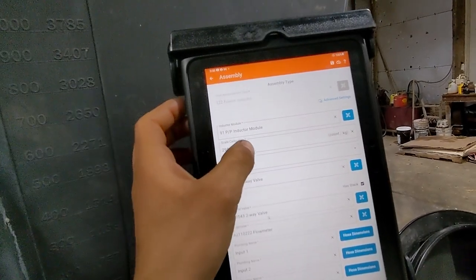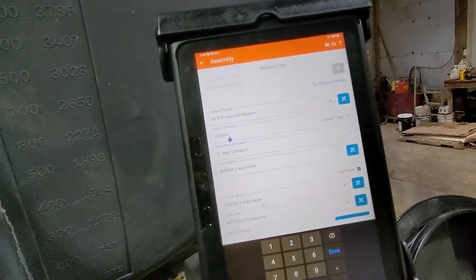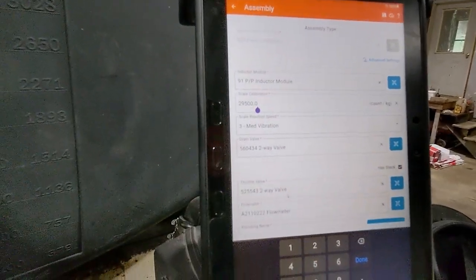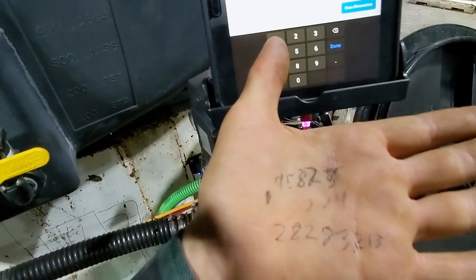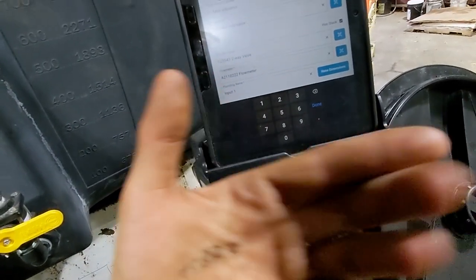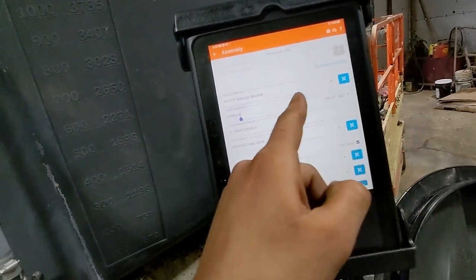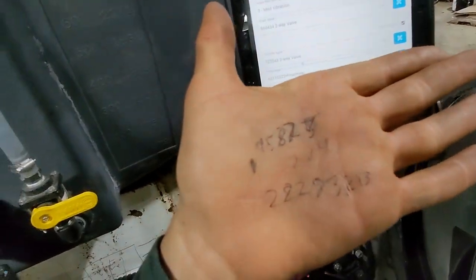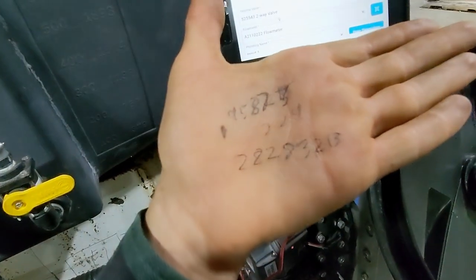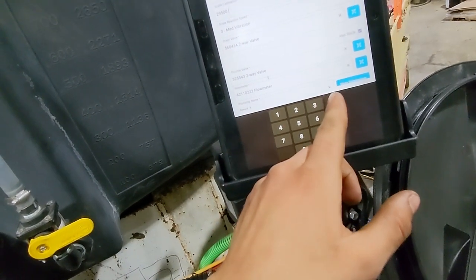Here, scale calibration. Oh, this is count per kilogram. The top number here is how far we were off. So we had 0.95825 of 28.5 pounds. So we multiply that number by the current calibration. It doesn't matter what unit this is in, because we're multiplying this by the percentage that we actually had. And that comes out to 28283.213. So let's put that in here, I guess.